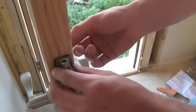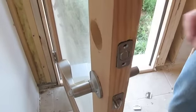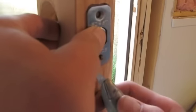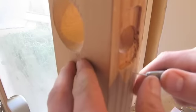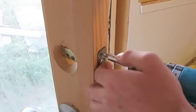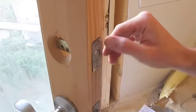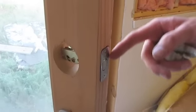Then start installing the deadbolt. Check and see if it fits — it actually needs to be cut down a little bit, so grab your box cutter and make the mark, cut it out, then pull it back out. Now put the screws in. As you can see there are some little gaps — you can fill those later with some hole filler, some spackling, paint over it and it's just fine. Wood filler works pretty well too.